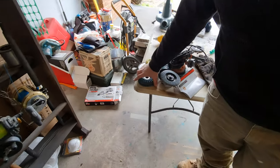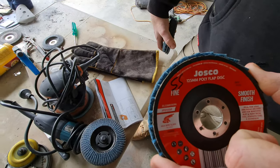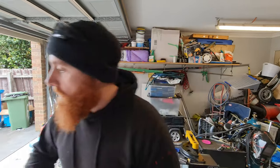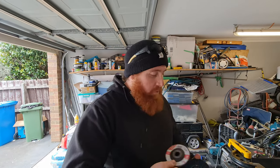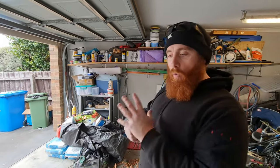A little hint for the kids playing at home: on the back of all my flapper discs you'll see 'SS' — stainless steel. All of them are marked. The thing is, stainless steel is expensive so you don't want to waste it. You can't use any disc that isn't marked SS. If you've been using one for normal carbon steel and then touch your stainless steel with it — grind it, polish it — your stainless will rust and corrode. Why? Because it penetrates and puts iron into the steel. Wire brushes too — they're all stainless, you can't use them for a minute on standard steel.